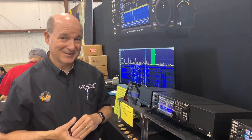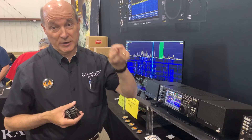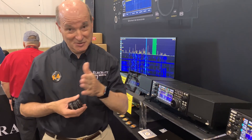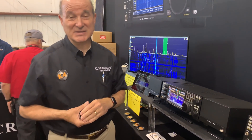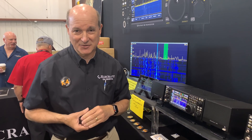Speaking of key clicks, are you going to allow any adjustment on the rise time? We actually already have a sigmoidal rise time, so it's optimized for minimal key clicks. If you look at QST reviews where they send a string of dits and look at the spectra — we're not going to let you shorten it so you can be wide. That's actually fixed on all our radios. You can actually hear a K3 and recognize it on the air; it's really nice on CW.